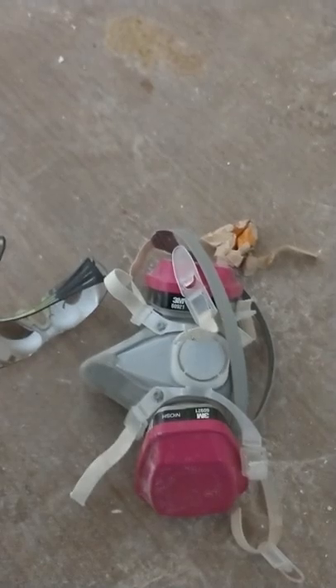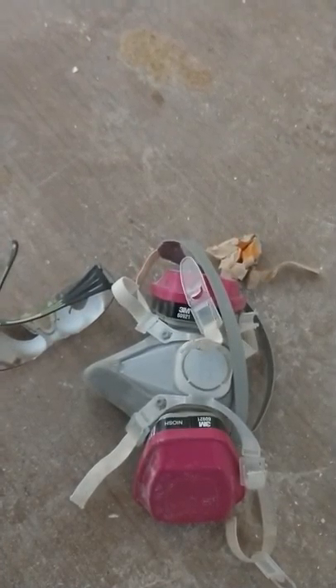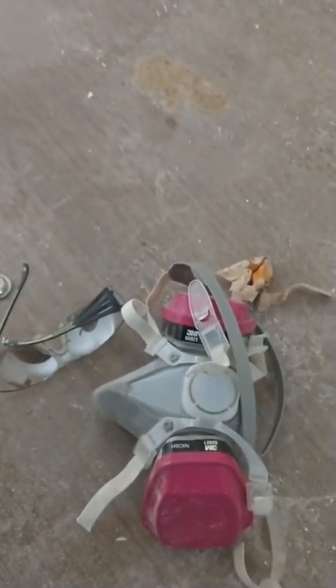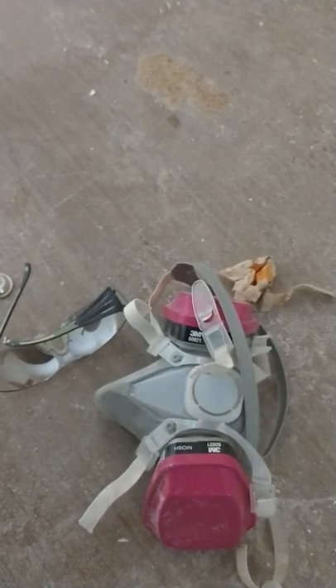What we're doing in here is a light coat of orange peel. For other tools, we've got a respirator mask — or you can use a dust mask. I highly suggest using a mask. The texture coming out of a hopper is going to aerosolize into the air as a very fine mist, and you will breathe it. It's pretty gross to clean out your nose, throat, and mouth from the texture buildup if you do this for more than 30 minutes to an hour.